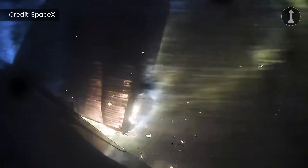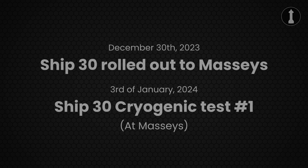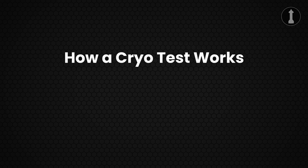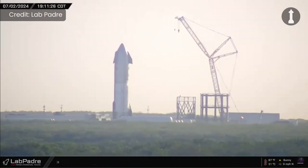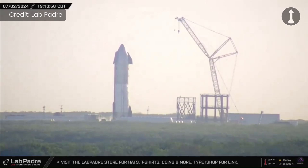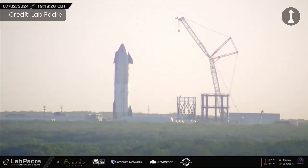During the editing of this video I found out there are no videos of the first two tests, so I'll overlay some footage of previous tests. The testing campaign for Ship 30 started this year — on December 30th last year, Ship 30 rolled out to the Massey's test site in preparation for a cryogenic proof test of both methane and oxygen tanks, which took place on January 3rd. Cryogenic proof tests use liquid oxygen in the oxygen tank and nitrogen in the methane tank to verify the structure of the vehicle. They won't use methane as it's flammable, whereas nitrogen isn't, so it's way safer.